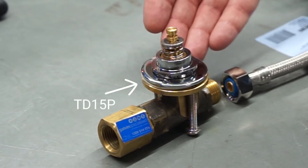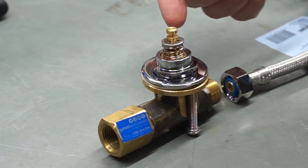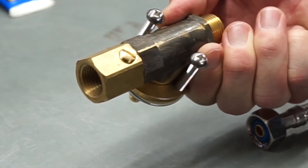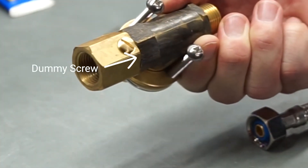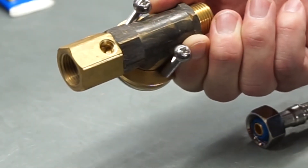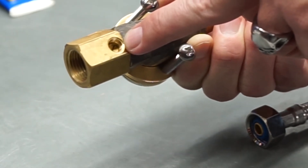This is the main body of the unit that's installed inside a trough. The first thing you need to know is the adjustable flow control. On the bottom of the valve there is a dummy screw. If that screw is removed, it will reveal a screw underneath — that is the one you will twist to adjust the flow.